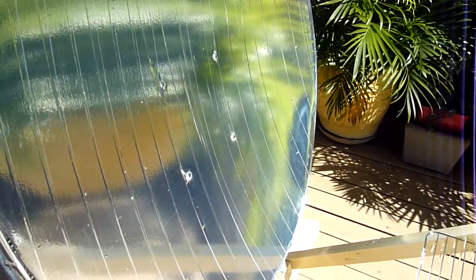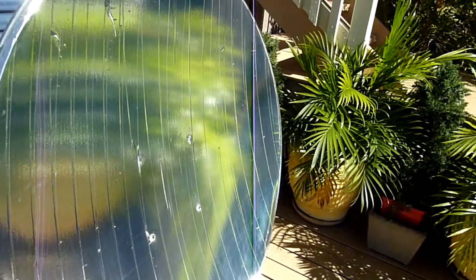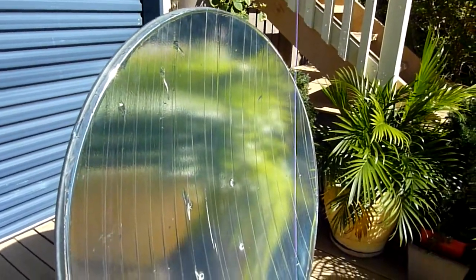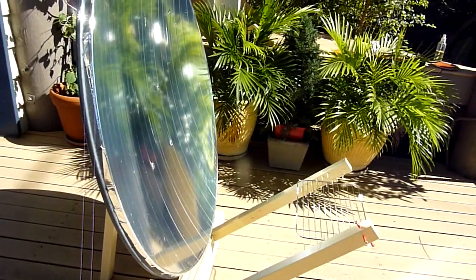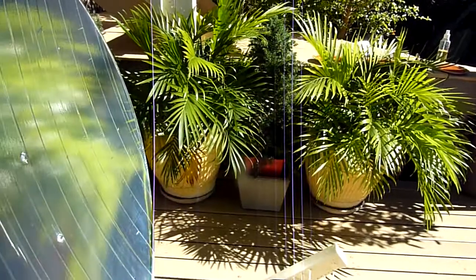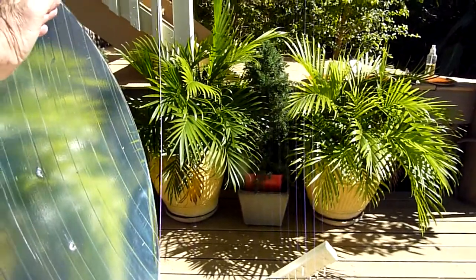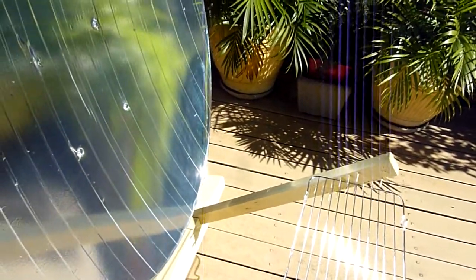It works out pretty well. Before you do much construction, I recommend you go out on a full moon night and experiment with the focus and the offset angle. The offset angle for this one is 27 degrees, so those arms are sitting at 27 degrees from the vertical. Normally a parabola's focus is straight out, but pay TV operators use an offset parabola so reflected rays come in and down to the dish to the grill here.